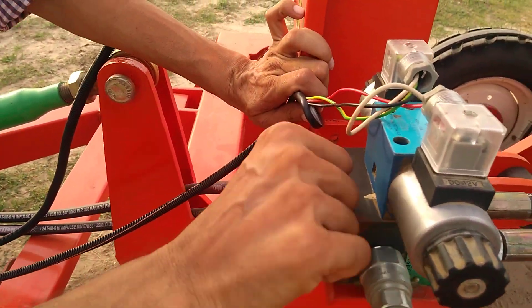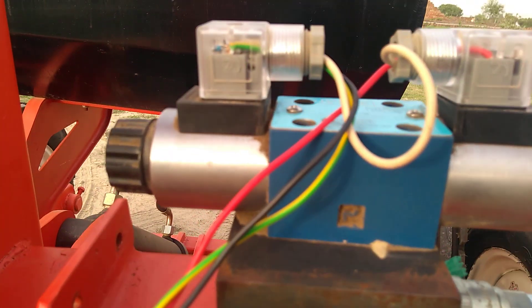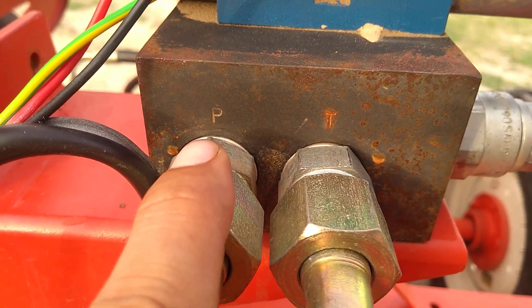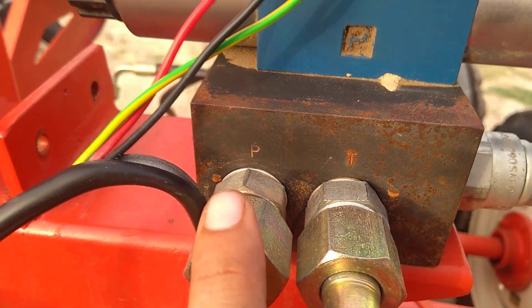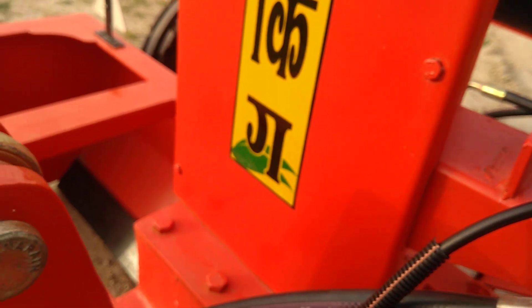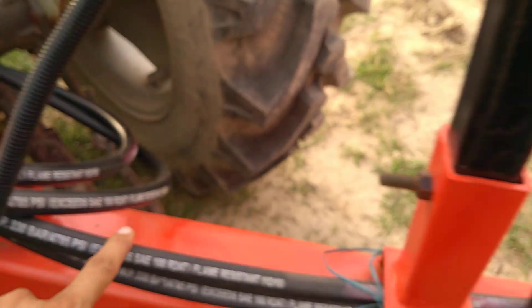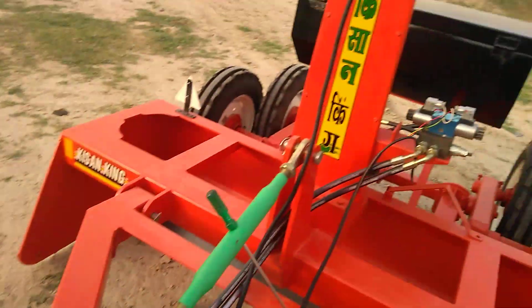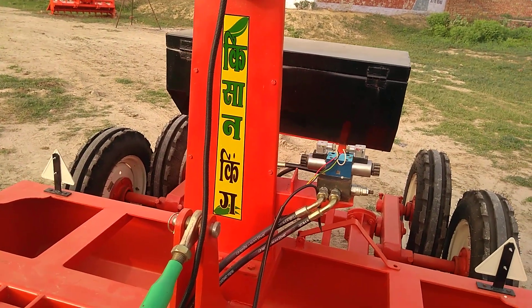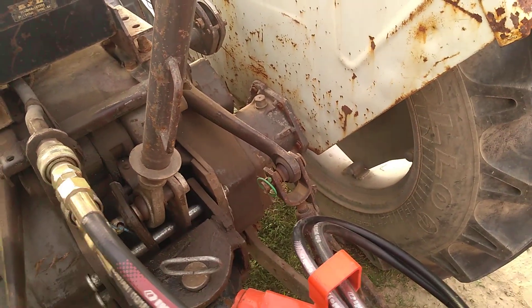There is a special place for this pin — you have to put it in this way. Same. Okay, then the hydraulic pipe — you come here, you can see there is a marking. You can see clearly: there is P and T. P means pressure. You have to connect this P with the tractor hydraulic pressure. This is the pipe for P — that means this pipe should connect to that wall where P is mentioned. P means the hydraulic pressure should go inside the leveler from this pipe.